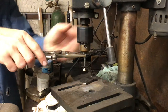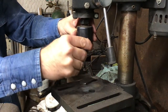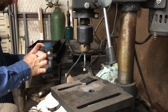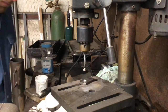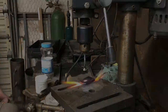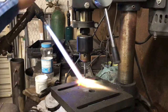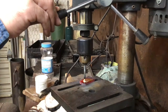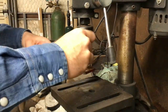I've cleaned up and scratched up the end of that solder that's on the end of the screw, then I dip it in flux again. My plate of stainless steel is completely clean. Then I chuck up this in the drill press and line up the plate. I've got a center mark on it and just line it up right underneath it. Then I add just a little bit of flux to it — this is going to be just like soldering the end of that screw. I'm going to heat it up until that piece of stainless gets like a dull red, then switch my heat to the top side and press down with the drill press. What you'll see is just a real small shimmery line form all the way around the screw, and that's when you know that solder is flowing into the stainless and you're done.